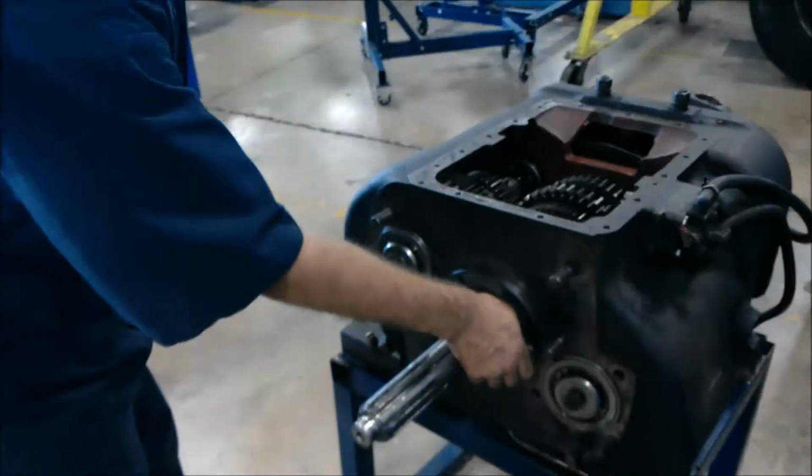Alright, now if you see this, this is where our snap ring's gonna lie. Looks level with the input shaft. Alright, so now I can put my snap ring on. Use the eyelets, stick them onto the end of the snap ring here. Gain you more distance. What helps make it better is to put the bottom on, then the top.